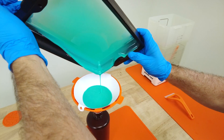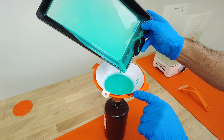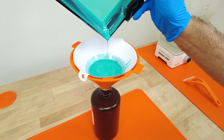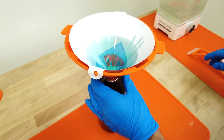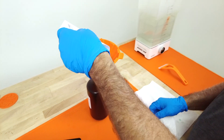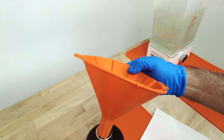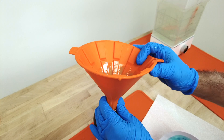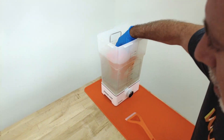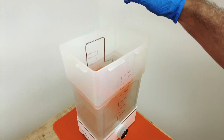The fluted areas permit a very fast pour because they allow air to escape while the resin is pouring — I don't have to hold back; I could empty a whole vat of resin in there and it will filter thoroughly. The fluted pattern is also keeping the paper filter from cutting off the flow. When it's all done, you just throw out your paper filter, wipe down the funnel — it's totally impervious to resins and IPA. And since it's foldable, it will even fit right inside your cleaning station, so you can turn it on, let it clean, pull it out to drip dry, and you're ready to go.